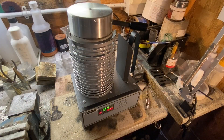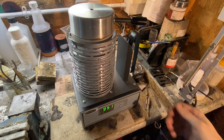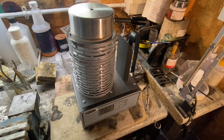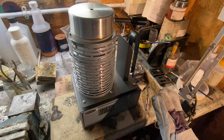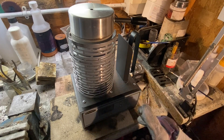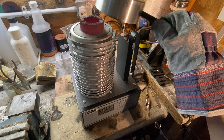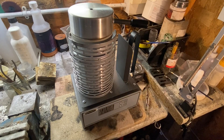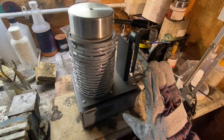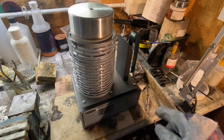Once you've finished your casting, remember it's still hot. Replace the lid and switch it off at the side, then disconnect it from the wall as well and leave it to cool. Now very important — depending on the temperature, this could take a couple of hours to cool down. The lid's very hot and the crucible is still glowing red, so that's going to take a few hours. Keep it safe, make sure nobody's around it, nobody touches it. Keep watching it — don't just leave it unattended overnight.